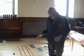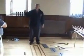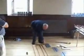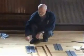And then once that's done, we're ready to put them in the boxes. Now in the boxes at the back, like you've got there, you should have a single layer of that insulation. It doesn't matter if it's in bits and pieces, as long as the base is covered. And you need to drill 2 holes to let these pipes out here. And you can get the position of the holes by looking at the thickness of the insulation, because the pipes will be up from the base by the thickness of the insulation, and they'll be in from the end by that distance there. So that allows you to get the holes for these pipes to come through.